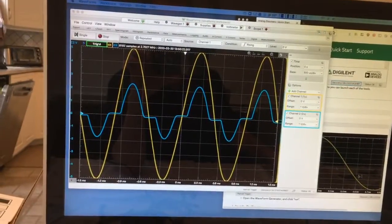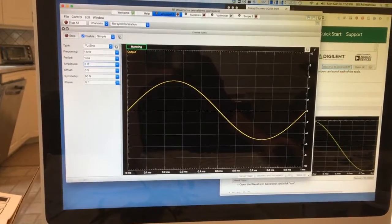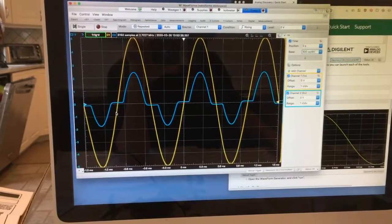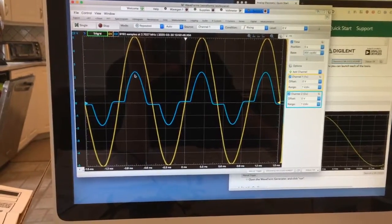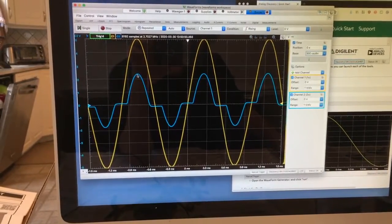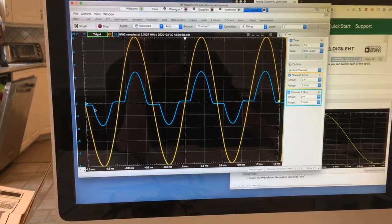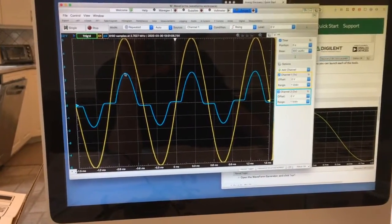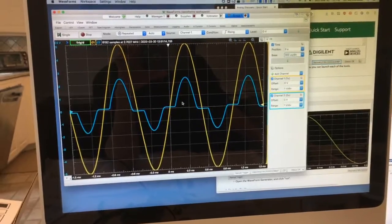And then if we look up on the scope display, here I can show you what I'm putting in first. If I go to wave gen, this is a 5-volt amplitude, which means 10 volts peak to peak, sine wave at 1 kilohertz. And then we'll go over to scope, and you can see it looks kind of like a familiar push-pull output, except that the crossover distortion is really extreme. Instead of being a 0.6 volt diode drop, it's a 2.5 volt V threshold offset. But you can see it follows with that enormous, ridiculous diode drop, the V threshold, and then there's crossover distortion, and then it follows the upper half, and again this reaches 2.5 volts, whereas the input actually goes to 5 volts, and then here's another flat spot from crossover distortion. So that's kind of neat.